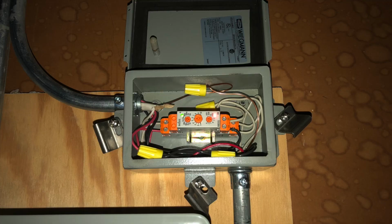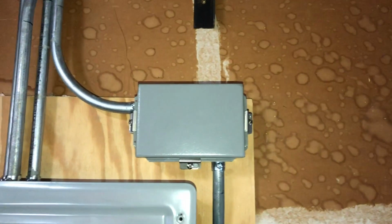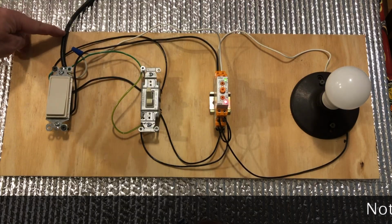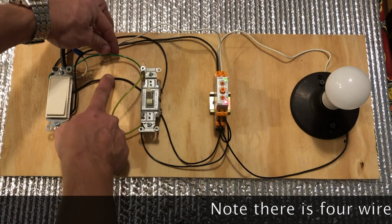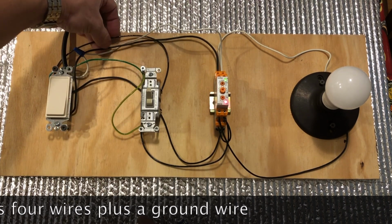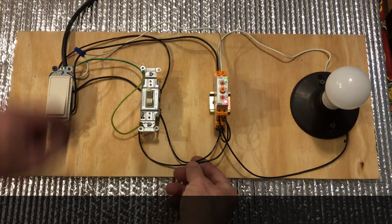The disadvantages are the need to have a separate electrical box for the relay, preferably with DIN rail in it, as well as having to pull an extra wire to power up the relay. For some people, having to hire an electrician for this might be a major disadvantage too.